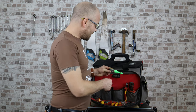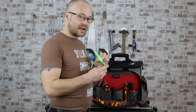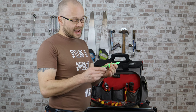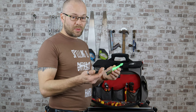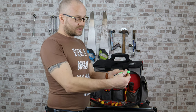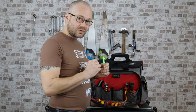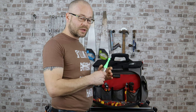In the centre pocket here, the Marksman. If you haven't come across these, I recommend you go out and look for them. It's basically a chalk-loaded air canister. If you've got holes that you can't reach with a pencil or a pen, you literally turn it round, push it in, it shoots a little dot of green chalk out, you take off your unit that you're doing and the holes are all there marked for you.